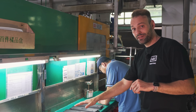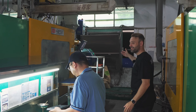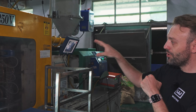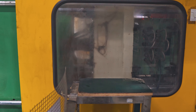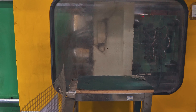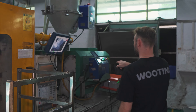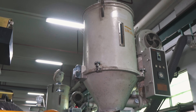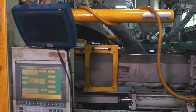Here we can see the ATHC bottom case which just came out of the injection machine. Here we have the entire injection machine and from the window we can see where the mold comes together. You have these two metal molds, a male and a female side — they come together and are pushed against each other. There's a spout area where the plastic gets injected, which goes all the way back to a feeder containing little plastic pellets that get funneled in, melted into a liquid, and then injected into the mold, becoming the bottom case.